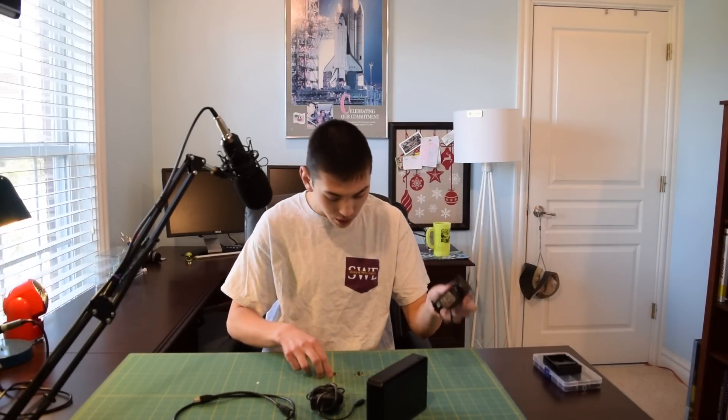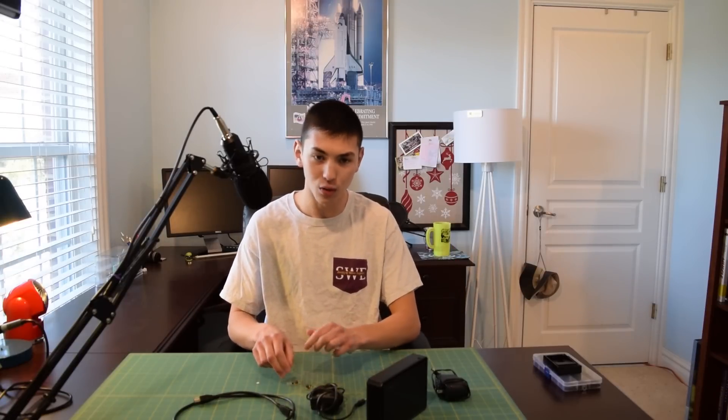So sit back, relax, watch, and tell me what you think I should do next — whether I should give up on this completely or maybe there's a different solution. The goal of today's video is to get this 3.5-inch drive enclosure running off just USB, without having to use a 12-volt power adapter. We're going to do that by using these 5-volt to 12-volt step-up modules — you can pick these up on eBay for about 99 cents each. The whole project is probably going to cost under three or four dollars once I buy the USB cables from the dollar store.